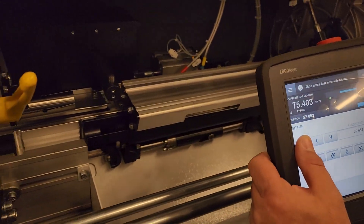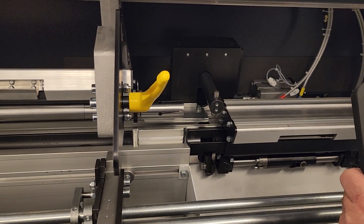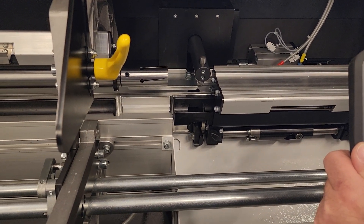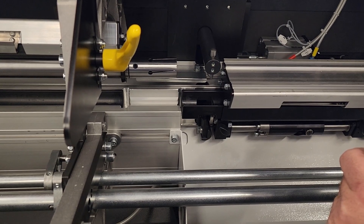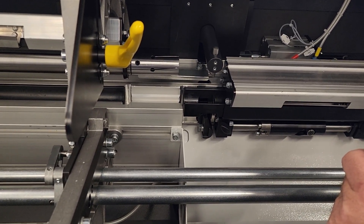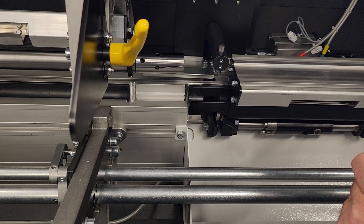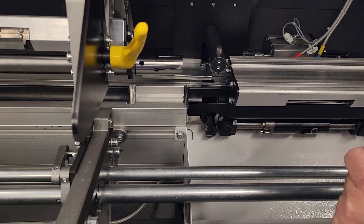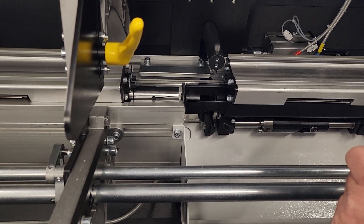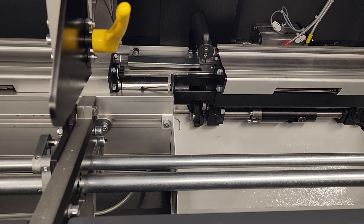The last thing we need to do is perform a bar on sequence. Once you perform a bar on sequence, see if you still have the alarm. If you do, you can increase the short pusher front position slightly more — usually by about a hundred thousandths at a time — until the alarm stops. If you do that two more times and still have the alarm, then you probably have another issue like a worn clutch, bar stock that's too big for the collet, or a collet that's too small for the bar stock. But starting with setting these two parameters correctly is the first step to make sure the machine is set up properly. Once you've done that, you can troubleshoot further if you're still having this problem.